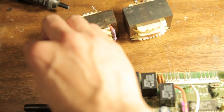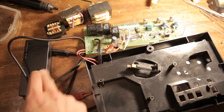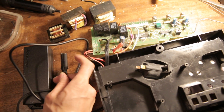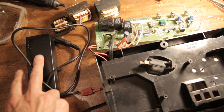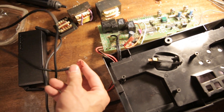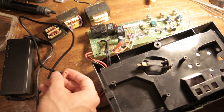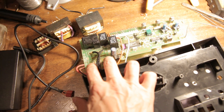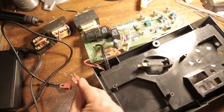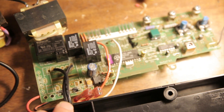I gave up on modifying a transformer. I thought laptop power supplies usually have a high voltage close to 20 volts, and it turns out it is 20 volts — so I can use this. I jumped out the AC cord so the AC comes out on this one. It's protected so people can't touch it. I plan to put this externally so any heat can radiate out. The DC out is 20 volts — you can see it's somewhat protected. I've jumped out the spot where it wants 20 volt AC, but I can put in DC instead. The wire goes through the hole in the panel.